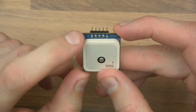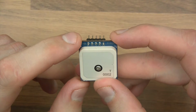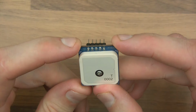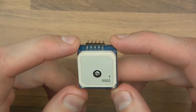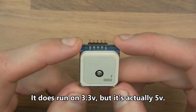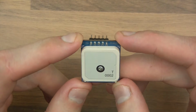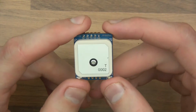So the pins, we've got INT, VDD, TXD, RXD and GND, and INT stands for interrupt, but we won't be using it. Then we've got VDD, which is plus voltage, which I think is plus 3.3, I think. We've got TXD and RXD and ground. Ground obviously goes to ground in order to complete some sort of circuit in order to power the thing.